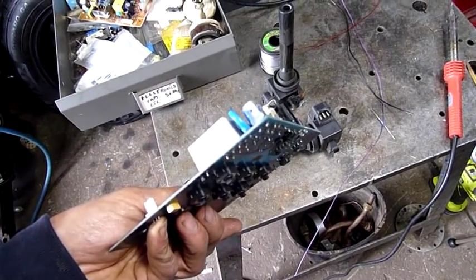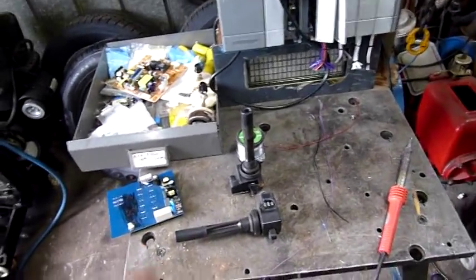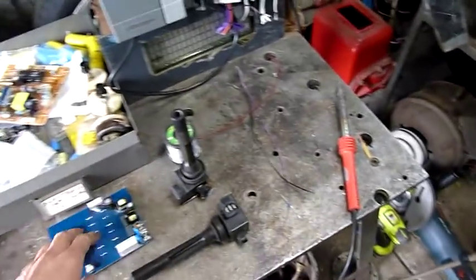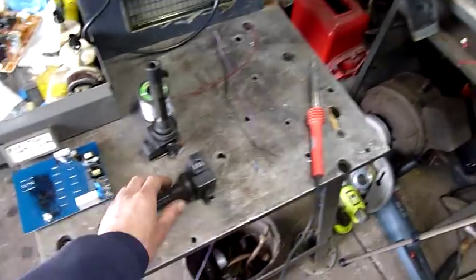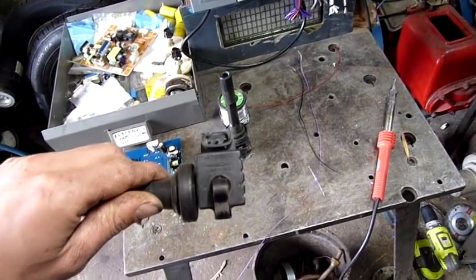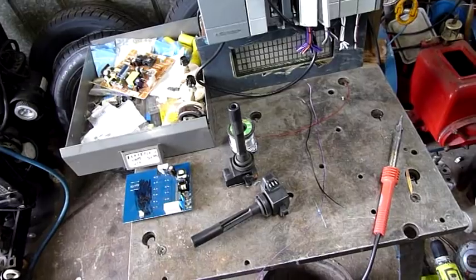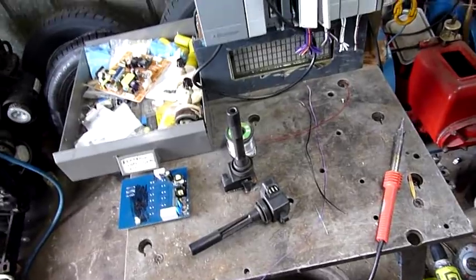This relay has a normally open and normally closed contact on it, and it works. I know that because I tried it at work using one of those relays off the same dead controllers — these ones here were an older model which suffered a bit of water damage and died, so there's a bazillion of them floating around at work getting thrown in the bin. I'm using the CM11-102 coils from Hitachi, which came off an Isuzu Rodeo V6 engine. Might as well demonstrate how the driver works — all it's doing is using the relay to make and break contact so many cycles per second.